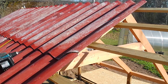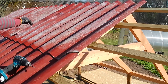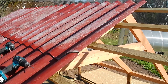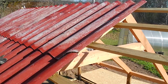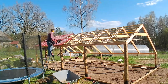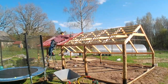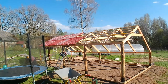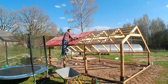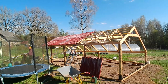I need to drill the holes, put the fixings in — there are four fixings on each tile. After the video's finished I went around with a ladder on the other side and did the top fixings. That's all you need — four per tile — which is all we've got on our main house roof as well. I don't know why these profiled cement fibre sheets aren't more popular here in Latvia and in a lot of other places in Europe. I do wonder if in the UK people got scared of the asbestos stuff, which was the original fibre in cement — obviously no longer used. Maybe that put a lot of people off, but as a roofing solution, they work really well and they cover a big area fast.